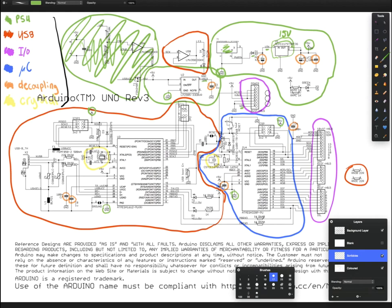It would be very unusual to have a complicated digital circuit with just one voltage rail. If you look at a normal laptop computer, it's reasonable that there could be 5 to 10 or even more different voltage rails inside the computer. And this is just because different chips work better at different voltages. Maybe it's to do with some analog effect, or maybe when they run at lower voltage, they just draw less power. So that's basically the power supply. We have a 5 volt generated from a something, and a 3.3 volt generated from a 5 volt. And as you can see with all the net labels, net ports, sorry, they're spread throughout the rest of the circuit, and that's how you get your power in.